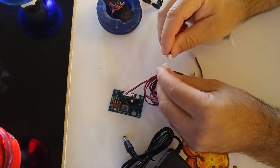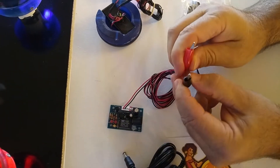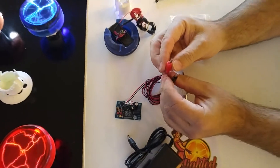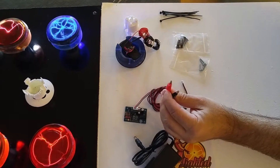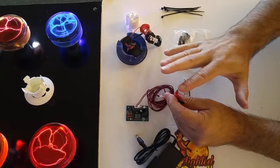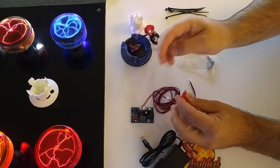This is going to control things as described. If you cut the light out, this hooks up to the original leads that your pop bumper light connected to. If you're in your game and your pop bumper is told to turn on, this will sense it and allows electricity to go through to turn on your pop bumper. If your game tells your original pop bumper to turn off, the signal won't go through — it will turn off.